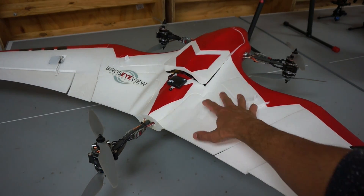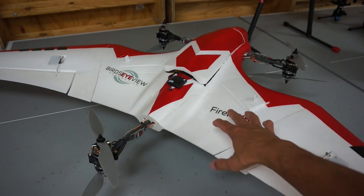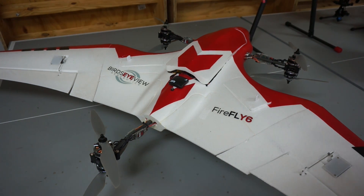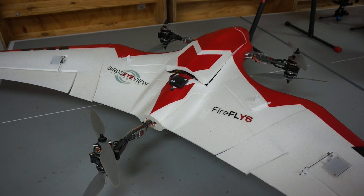Many of you have been asking about an update as it relates to the Firefly 6 and doing a fully autonomous mission. I was so close to getting this video shot at the field the other day. The weather was perfect, not very much wind, and I went to arm the Firefly 6 and I got the infamous Pixhawk buzzer sound that lets you know that it will not arm. What I came to find out is that the AVA firmware on this Pixhawk had expired — I was running an old version and it turns out there's an updated firmware.